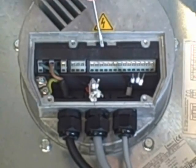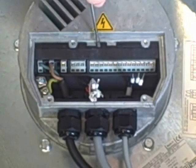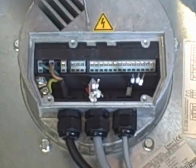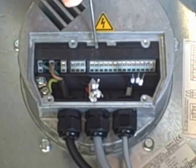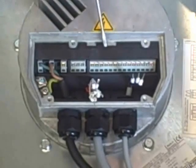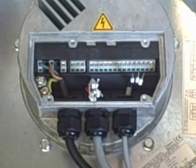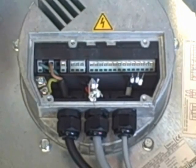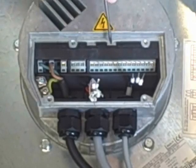Moving over, we'll find our first analog one. This will be your potentiometer switch, the first speed control. You'll have your ground, your zero to 10 input signal DC voltage, and your 10-volt control. Then you'll go to analog two, where you can use a pressure sensor, a temperature sensor, a humidity sensor — any kind of sensor that provides a zero to 10 input signal that you need for a secondary monitor.